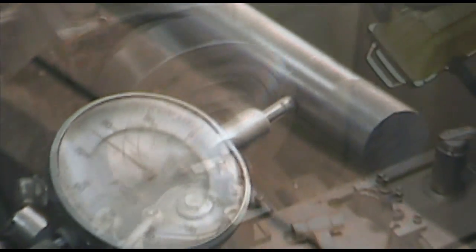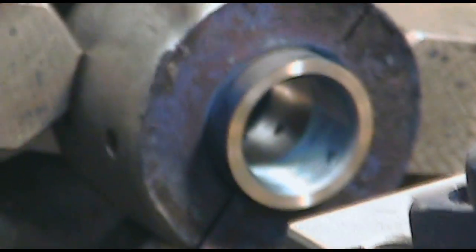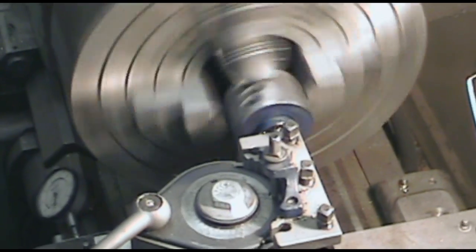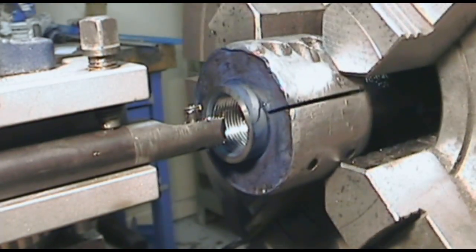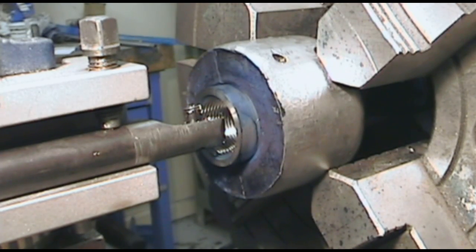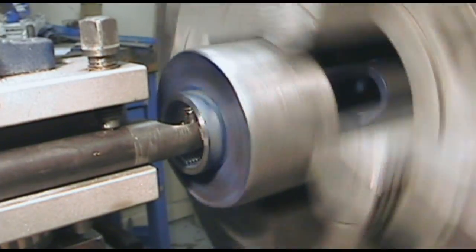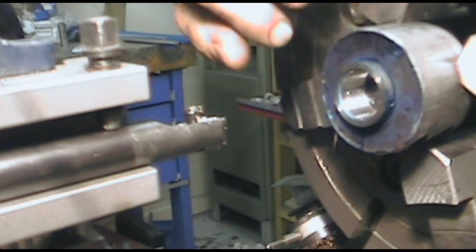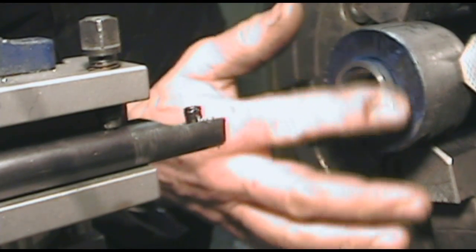Once the action has been correctly centered in the lathe, he begins cutting. Here we can see that the front face has been cut to allow the recoil lug to lay perfectly flat. Next, he moves inside and recuts the threads, careful to only take off what is needed. This is where the term blueprinting comes from — a blue dye is sprayed onto the action. As you begin cutting, the high spots will be removed first, revealing shiny silver metal, while the low spots which are untouched will remain blue. You can see where the original tool marks were still right there — he took off just the absolute minimum, but now it's square.